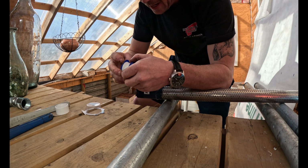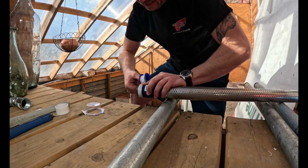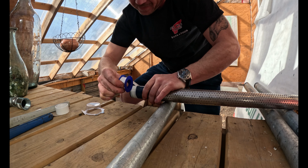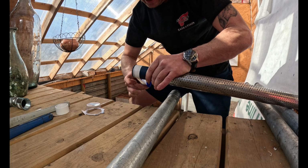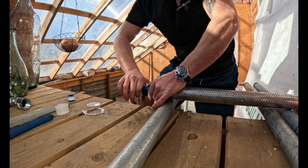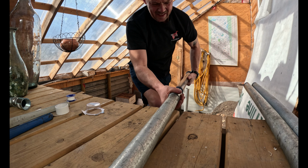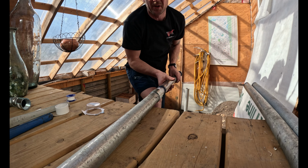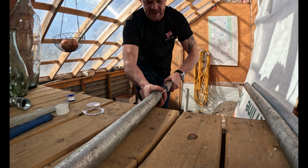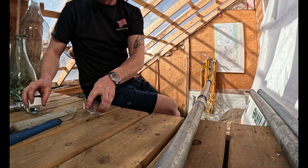You have to be sure to put Teflon tape on all your joints, guys. Very important to use galvanized pipe and not carbon, like black pipe. The galvanized won't rust out as bad as a black pipe. So I would suggest if you were going to put a sand point in, put it in with galvanized pipe. You don't want a bunch of rusting in your drinkable water.